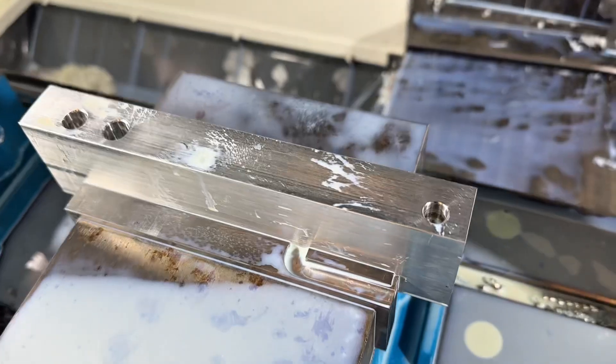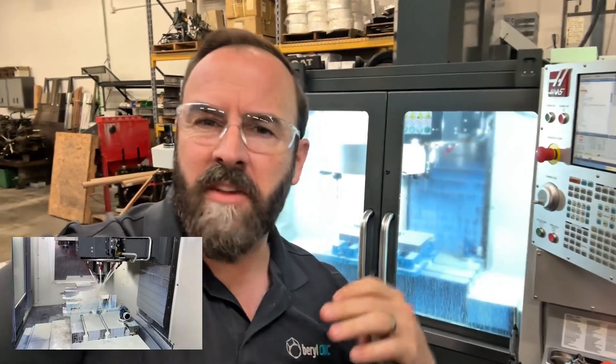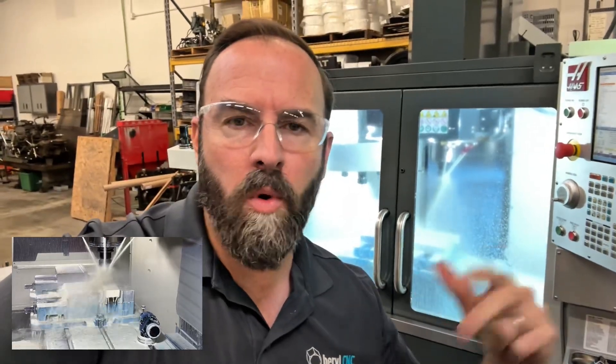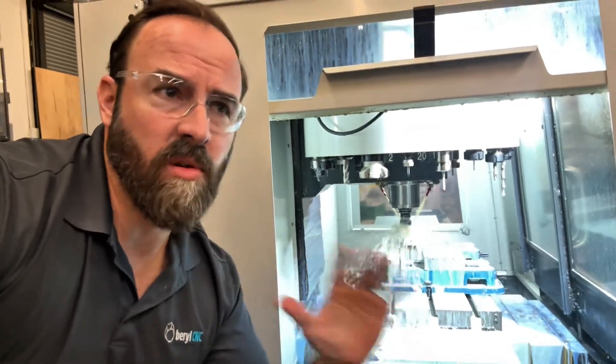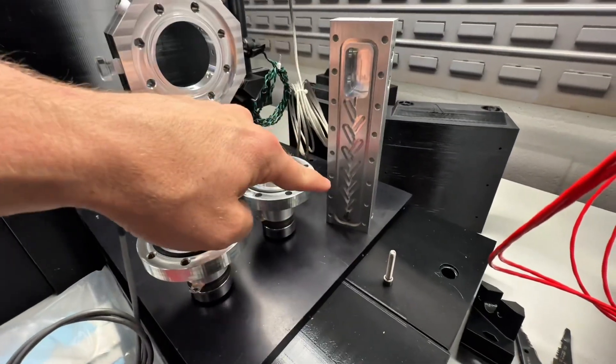Now we're cutting the left side where we have holes and NPT fittings going in — there's two quarter-NPT and one eighth-NPT, and that eighth-NPT has a quarter-inch hole going all the way through the other side because we've got a small sparger we can put in there that'll make the bubbles get very tiny, like a five-micron sparger. Now we're adding some mounting holes to the back of the manifold. When in doubt on an ad hoc project, I basically just do a one-by-one grid of quarter-20 tapped holes. Rigid tapping with a CNC machine is so satisfying — you know how much work that would be by hand.